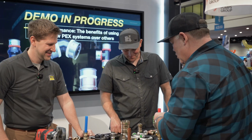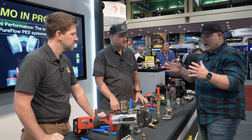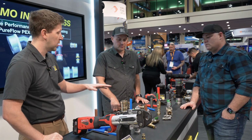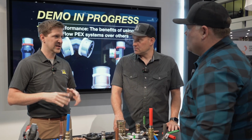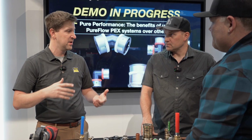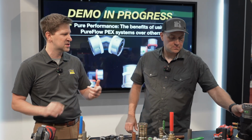No, that's awesome. So what else is new in Viega world this year? What are we talking about? I know you've got some new valves. You've expanded your balancing, shutoffs, all that kind of stuff. We are constantly expanding our valve lineup right now. We've had the ball valves for a really long time, but what we're looking at now is that full breadth of 1/2 to 4 inch for every material that you've got. And then above and beyond that, we're looking at getting your system set up for hydronic side, for potable side balancing. We've got automatic valves, we've got manual valves for your balancing systems, check valves and strainers.